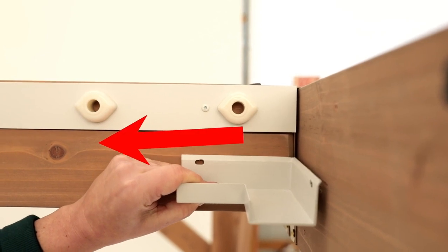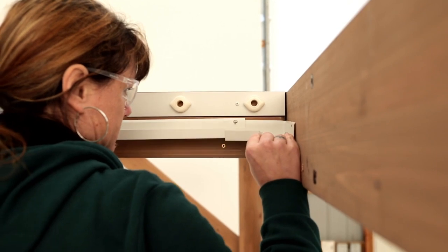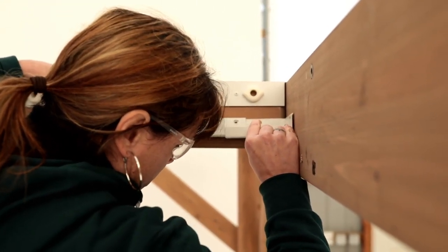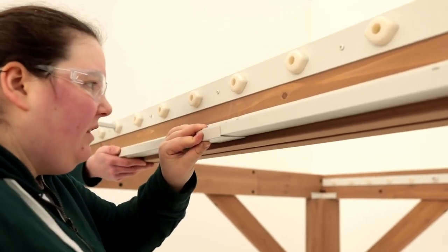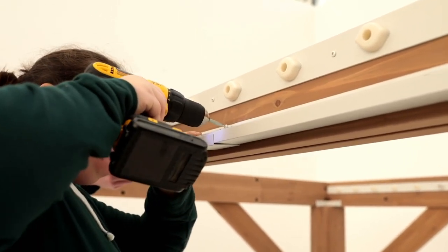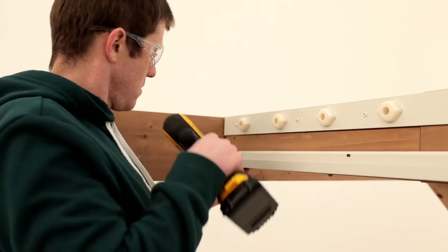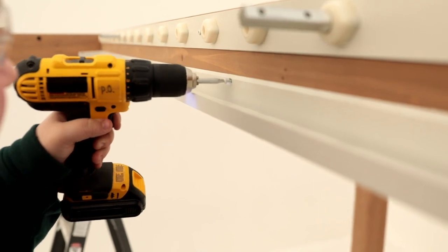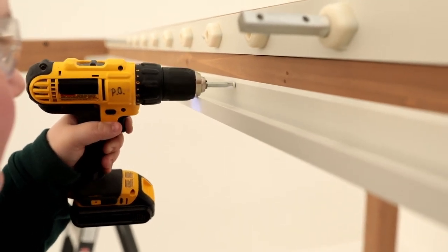Next, slide a rain gutter D into the gutter corner, making sure the joints are tight and all holes align. Then place a gutter connector so the bottom sits flush with the center mark, 1/2 inch from the bottom of the beam. Once all joints are tight and holes aligned, attach the gutter with pan screws. Repeat these steps for the other side of the middle beam assembly.